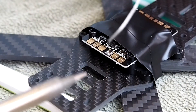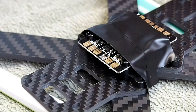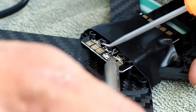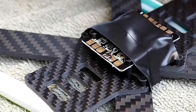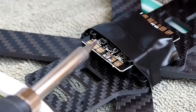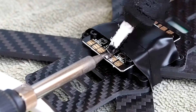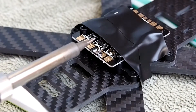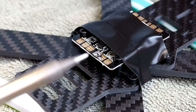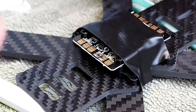To wick it away, I'm actually going to put some solder on the tip first — always — because you have to transfer that heat. And I'm going to have my little tool here at the same time. Let's wick some of this away. Pop that right on there. I think we're good there.